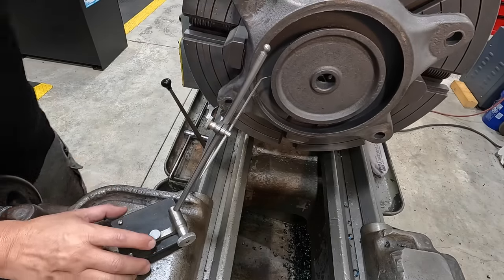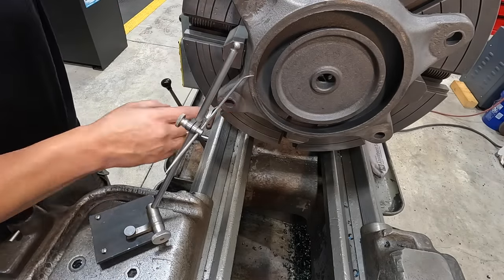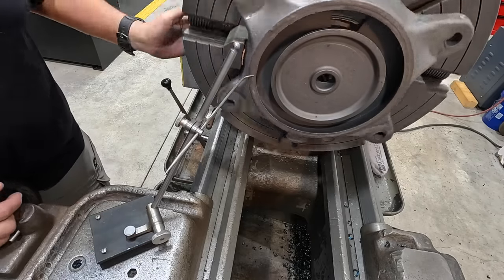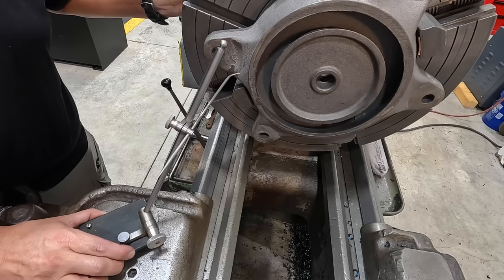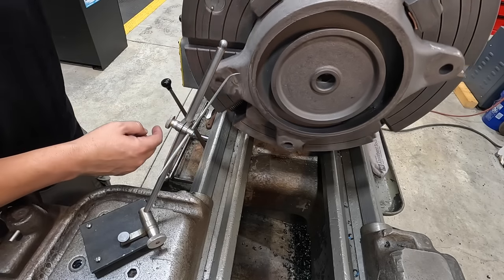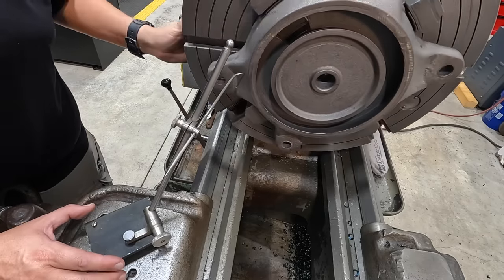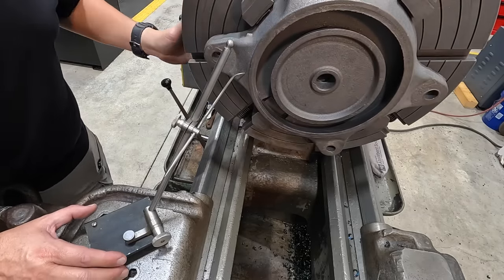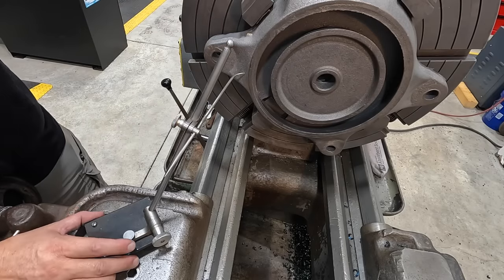You can do that on a surface like that. You can come around here and do it on the outside surface if you were trying to bump up a, you know, get a face bumped in there, or even the outside surface if you wanted to, maybe you want to indicate these four lug areas out here on the casting. You can bring that surface gauge right up there to the surface and use that as a point of reference on how far away your workpiece is to the point of that surface gauge.